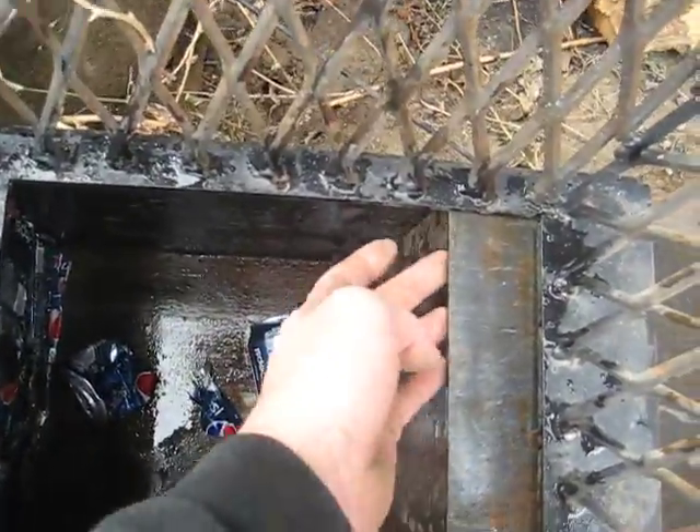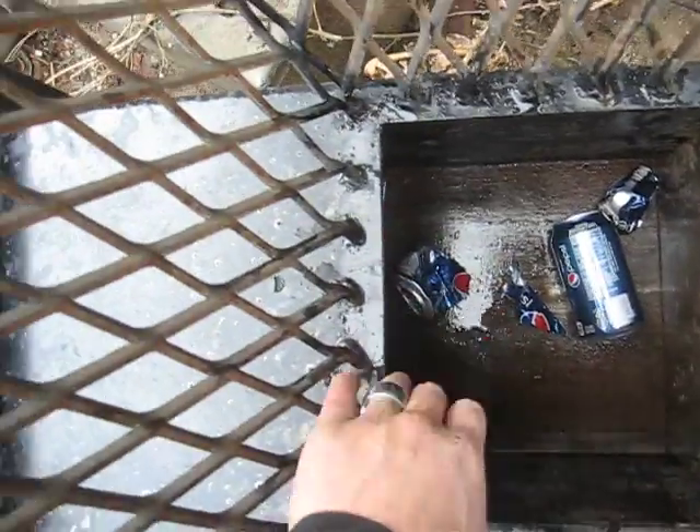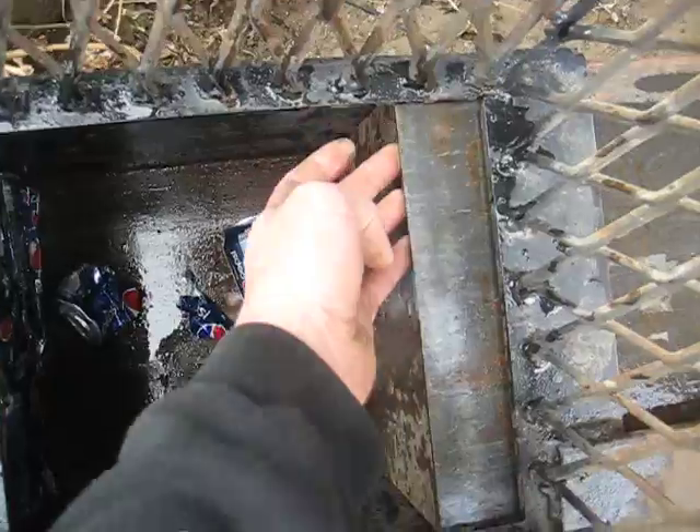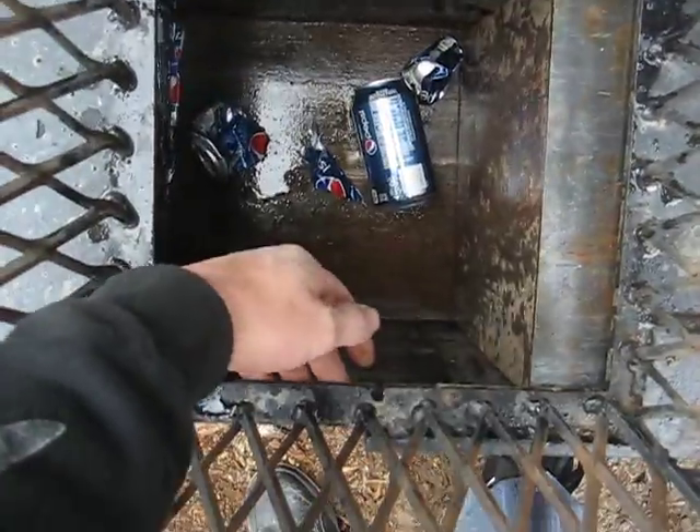This plate here is your shear plate. So when the cans go down in there, they get caught at that point and that will cut the cans off. It sticks over about a half inch, and I've got about a 1 inch lift there.